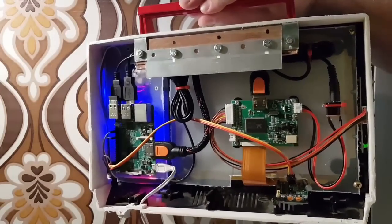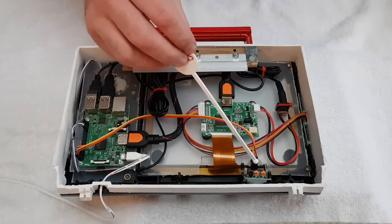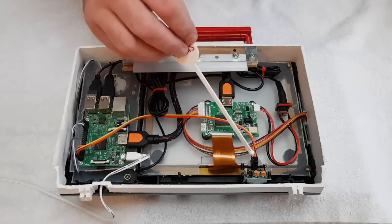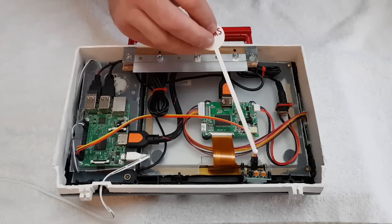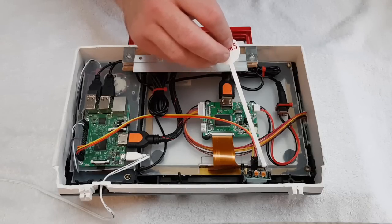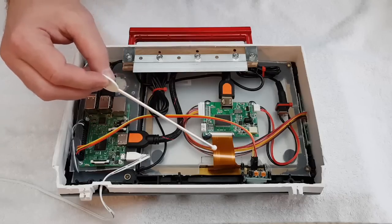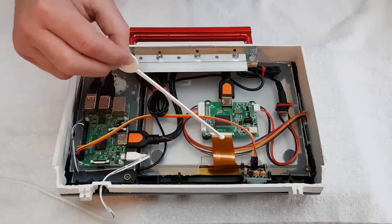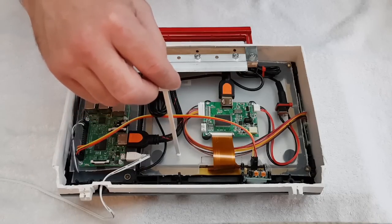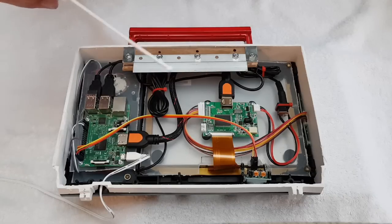Here's the Info TV on the table now, turned it over so we can get a good look at what's going on inside. Down at the bottom we've got the PIR sensor, the passive infrared sensor, and that detects motion when somebody walks past and disables the screensaver. You can just make out the two little trim pots there that adjust its sensitivity. Moving along, this ribbon cable connects the driver board — the driver board for the LCD panel — and the ribbon connects the board to the panel, which you can see through the plastic, held in by the original screws around the four corners.